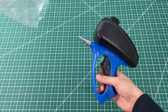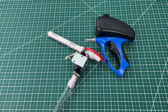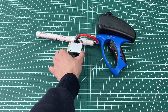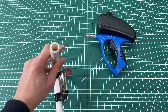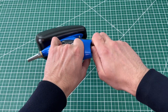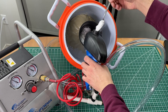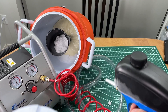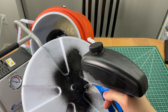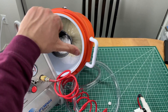Then something extremely devastating happened — we realized we can literally just buy one of these portable sandblasters from Amazon and fill it up with dry ice. Unlike our clear hose design, the dry ice chamber is already right above the air pipe and the trigger is already built in. Our nozzle size was also way larger which means air travels slower than the Amazon blaster. To set it up we just attach a quick connect adapter and hook it up to our compressor. We scoop some dry ice in and we're ready to start blasting — though note just how quickly compressor pressure was reduced. We're gonna need a much larger tank than one gallon if we're serious about this.